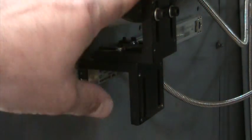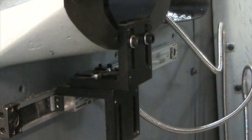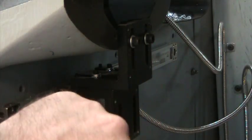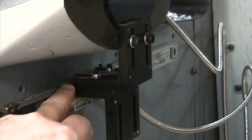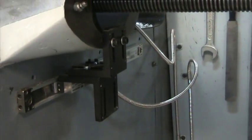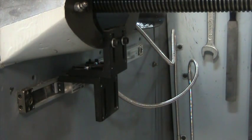You can see the reader arm is drilled into the underside of the apron here with two screws - I think those are 6 millimeter. We've got slots in the arms provided with the DRO, and I've got one angle bolted to another angle going down. Ideally you could probably truncate the bottom of this off - I haven't done it yet because it doesn't really interfere with anything, so that's one of my to-do items.